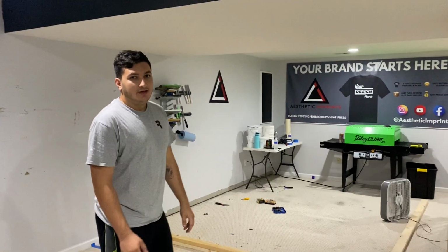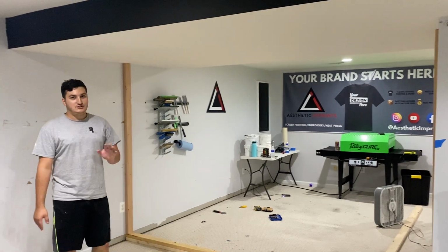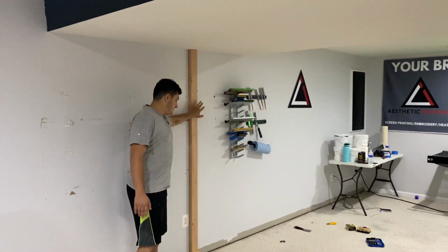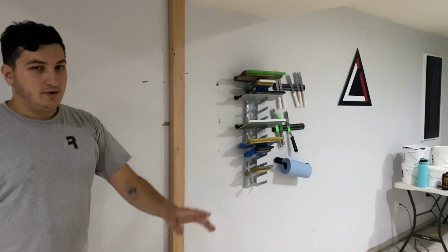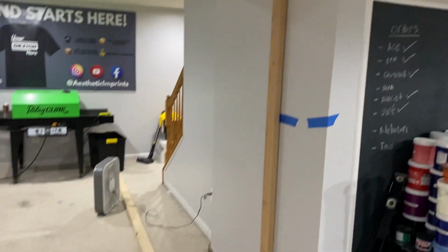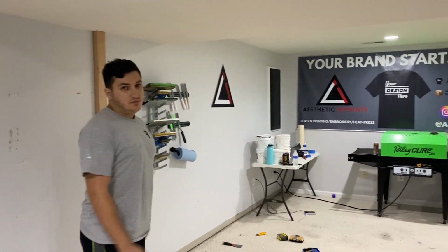All right, let them know. Hey YouTube, it's me again. I'm here to explain what we're doing. So we just framed what we're gonna do for the new wall. We got it tight on there. What you're seeing is two by fours stacked up and then touching the top. We're gonna take that big piece right there, we're gonna frame it, and then we're gonna put two more individual two by fours going in the middle so we could drywall it. And that's pretty much how we're gonna build our wall today.